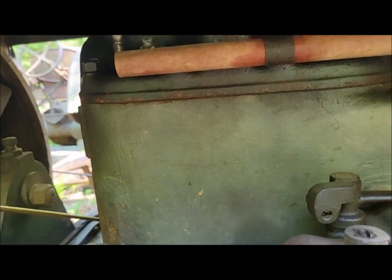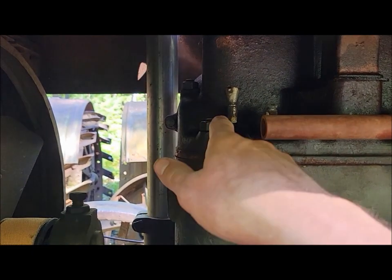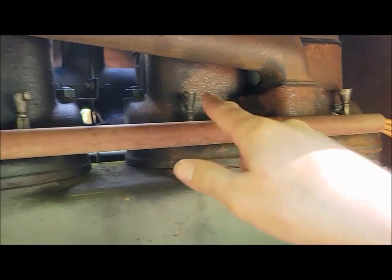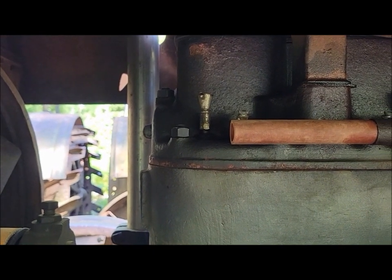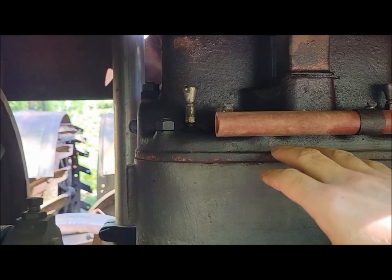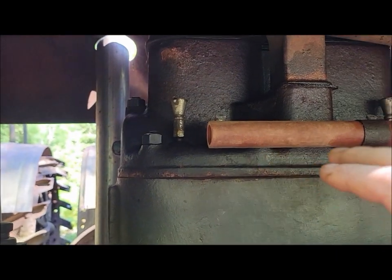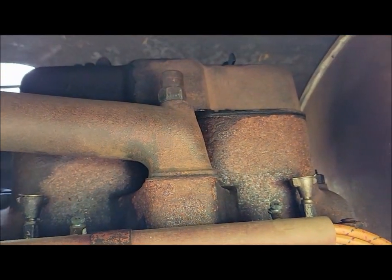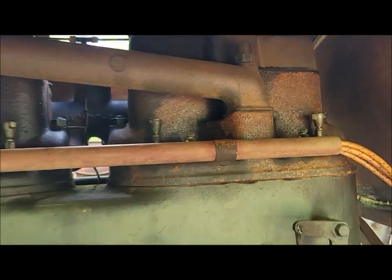The heads on a '27 are very specific. They were different that one year, where they have these primer ports for each cylinder. They would have these little primer cups on here. And the only year they used these particular heads was on '27, so they're a little hard to find. They are different than long fender heads, because they have a single valve cover instead of two separate valve covers. So they are not the same as long fender heads. They're '27 only.